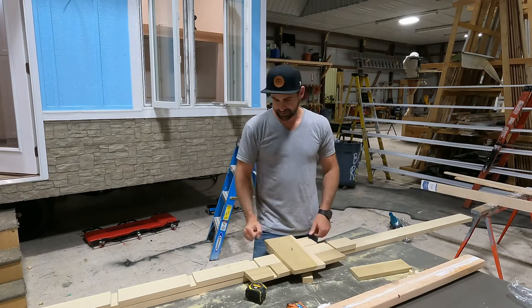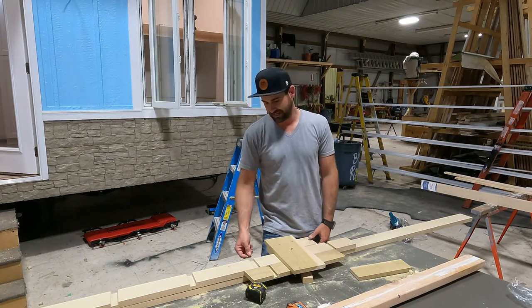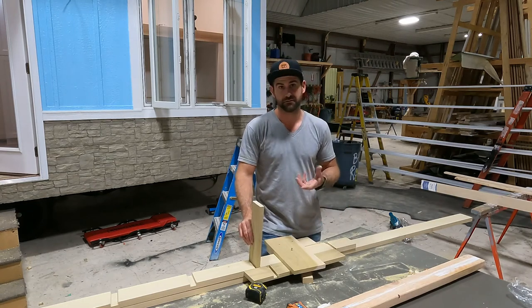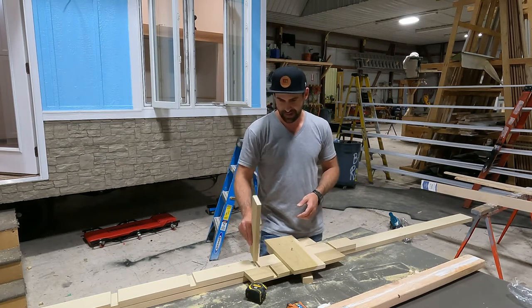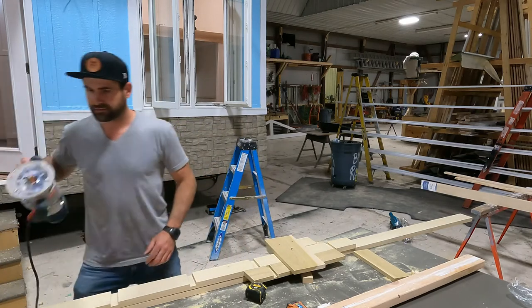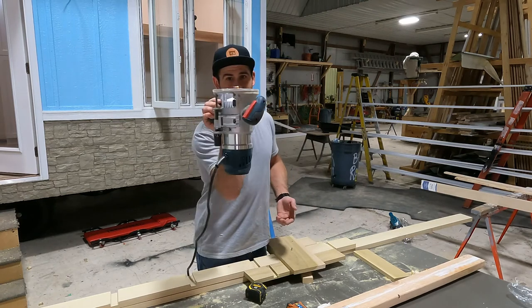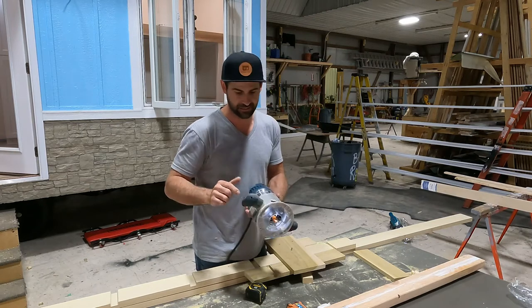It's a good solid material because I can take a 1/2 inch out of the face of the board, and I still have a 1/2 inch of a nice solid support, and my steps will also be 5/4 board, 1 inch thick, and they'll fit right in this notch. Now, the tricky thing is the router bit comes 3/4, unless you want to spend a ton of money and get a 1 inch, which you'll probably never use. Probably the most versatile router bit I have is my 3/4 router bit with the 1/2 inch shank.